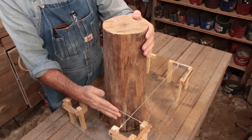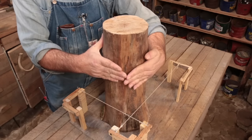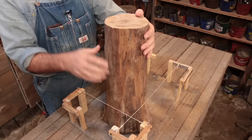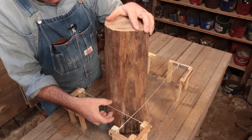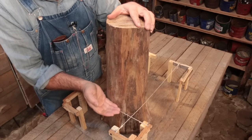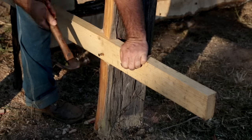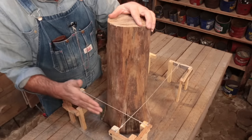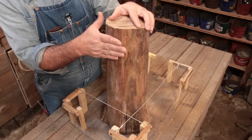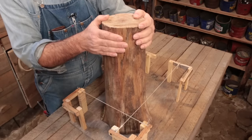And then when you put railings down low, a railing at the bottom and a railing at the top to nail your wall boards to, then your walls are going to be as plumb as you can get them. Now, there would be another option. That would be to set your pole so that the core is perfectly plumb. When you go to add your railings, this side is going to be a little bit past the string. When you go to set your railings, you're going to have to notch into the pole. If your railing is 2x6 or whatever, you're going to have to notch out a 6-inch wide notch in the bottom for that railing to go, because it's going to sink into the pole a little bit, and then your top railing may just be nailed to the outside, and therefore your railings would be perfectly plumb even though your pole is not.